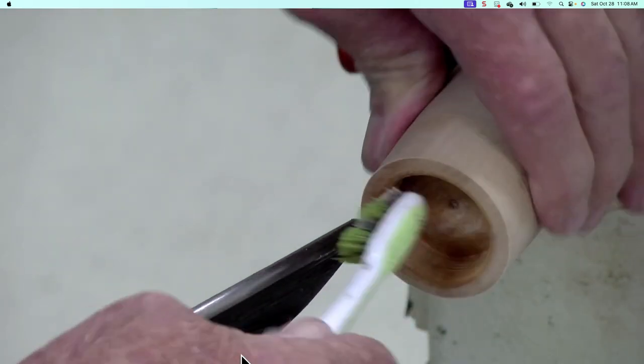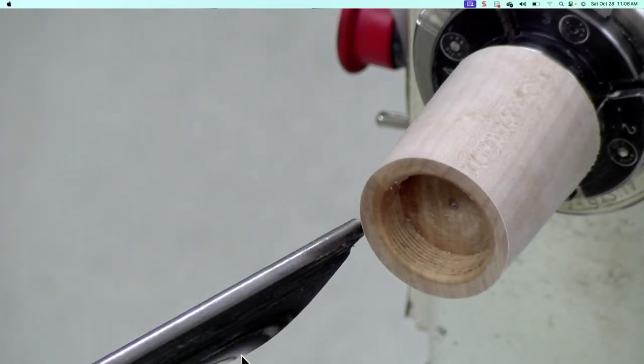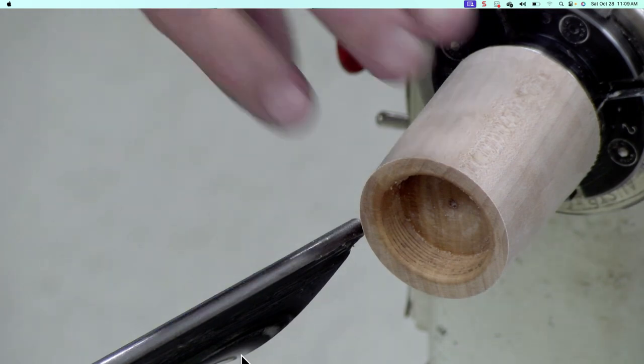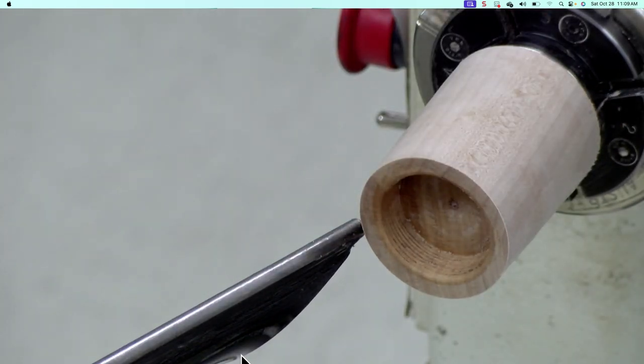Now, let me just run something by that we didn't do because we assumed that was parallel. We want to make sure, using the inside tool, that we get this parallel. What's ugly to thread chasing is if you have a taper. It doesn't work well. It'll start binding and all that other stuff. So you need the inside here as parallel as can be. So how we do that, I'm glad you asked, if I can find some tools,